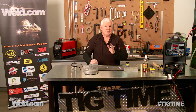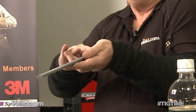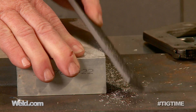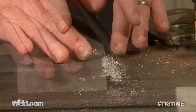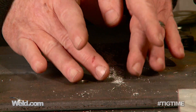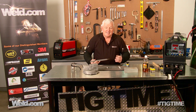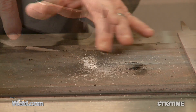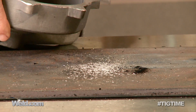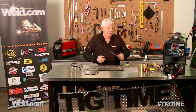So what we've decided to do is we've taken a little soft file — you can see it's a semi-circular soft round file — and we've actually shaved off some chips off of this aluminum and put them in a little row right here, and we're going to try to light it on fire to determine if it's pyrophoric. Aluminum is not pyrophoric, so it should not burn. We've also got some shavings over here — we filed them off of this casting and we're going to try to light it on fire as well. If it's magnesium, it'll light on fire.